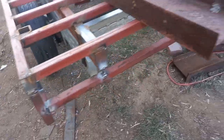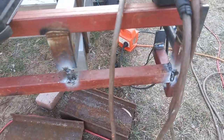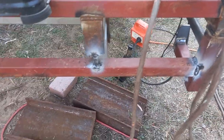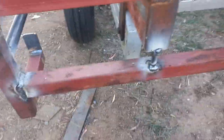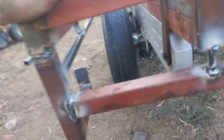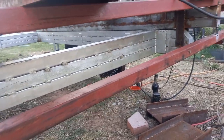Evening all. I thought I'd give you a brief about what we're doing in terms of the trailer. I've actually put the bar across the back now and welded that through. That's 135mm deep, so I'm going to have twin taillights here, and in here is going to be a number plate and also some reflectors.